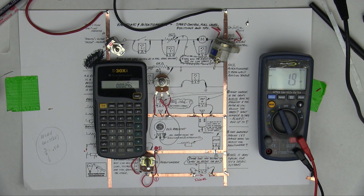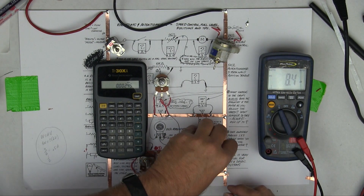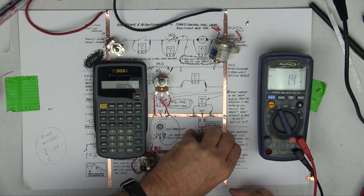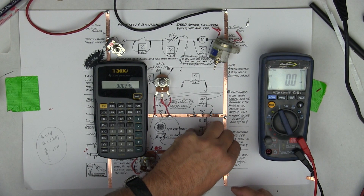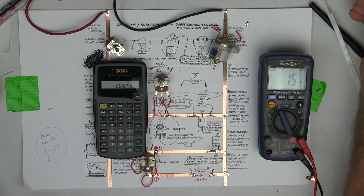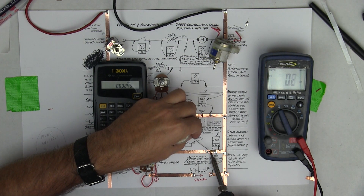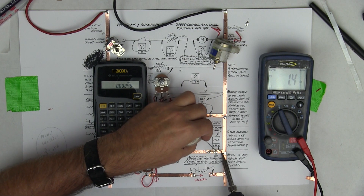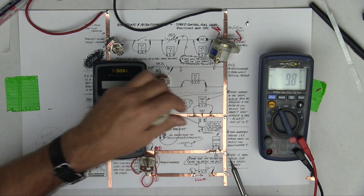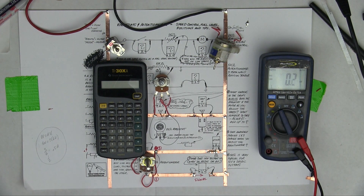I'm going to show you how to do this. The example I have is a coal mining machine that had four potentiometers providing position for four tracks. Three of the tracks were centered and one was not. I simply went to the schematic and found the terminals where the four sensors came together side by side. They were exactly where the schematic said. The schematics do work - if you don't let your people read them, you're hurting everybody.